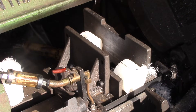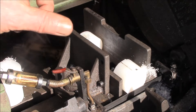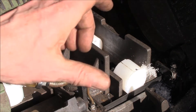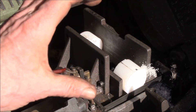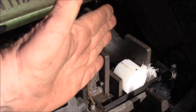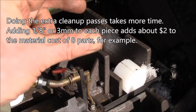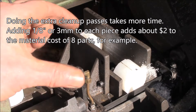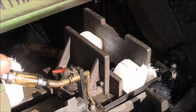I think that's looking a lot better — definitely a lot better than it was. The idea is I want to get these parts cut pretty square for a couple of reasons. First, they chuck up in the lathe square — you just put them in the chuck and drill and face them. The other parts I had, you had to adjust the part to sit square in the jaws because the end wasn't square, so you had to do a couple of cleanup passes. Also, if the saw is cutting crooked you've got to allow for those cleanup passes, so you use up more material. The straighter the cut, the less material you waste because you can cut parts much closer to finished size.